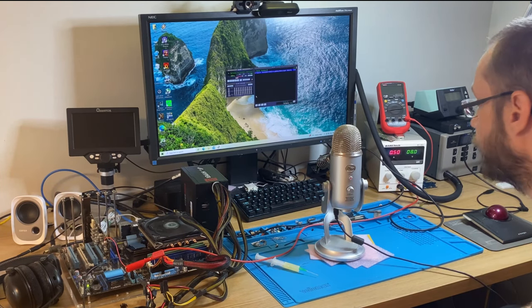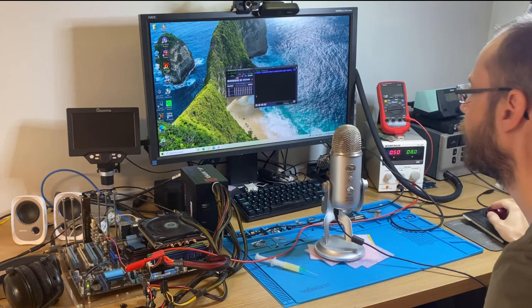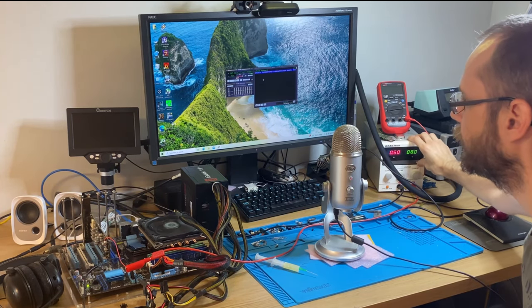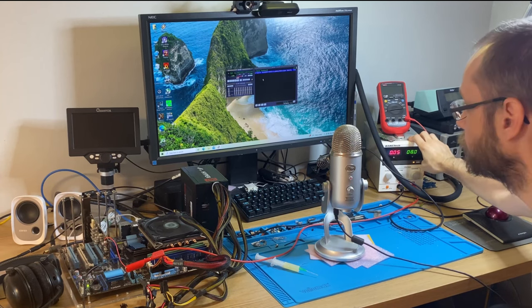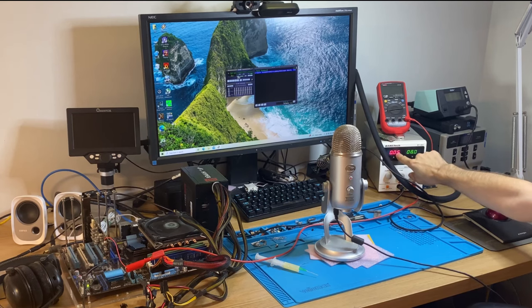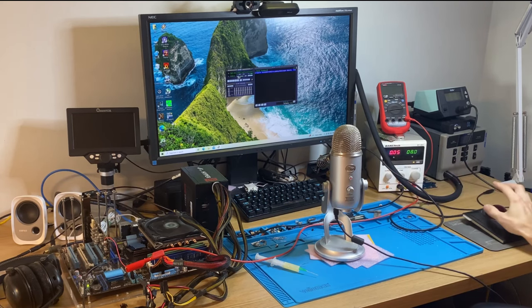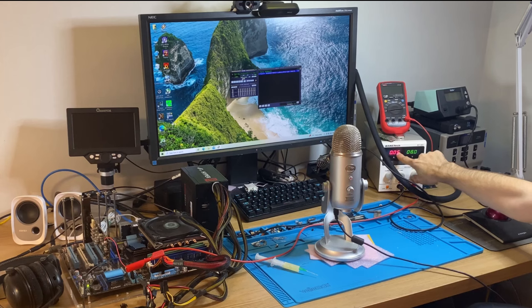There is sound, but you can't hear it. It's too low. I can't even hear it. So let's put on the power supply here again and see what's happening in the front channel. I'll turn the volume down a bit, but we can see we're pulling 50 milliamps. And the sound level have nothing to do with it apparently, so it seems as that's what we're gonna pull.